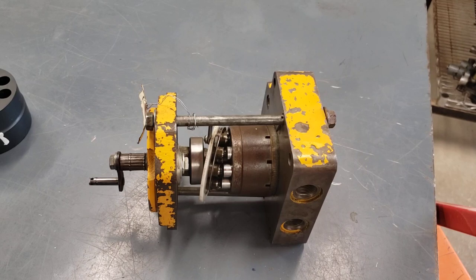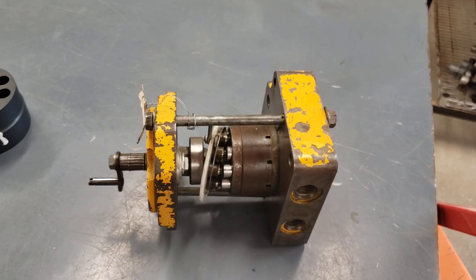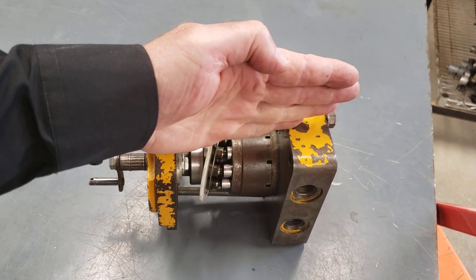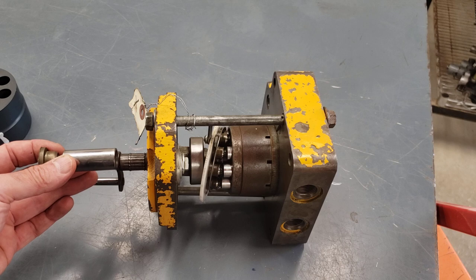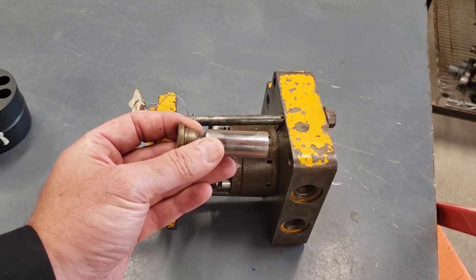So I want to start looking at axial piston pumps today. There's a few different designs of piston pumps in mobile equipment, but far and away the most common design is the axial piston pump. Sometimes it's called an inline pump, because if you look at where the shaft brings power into the pump, it's a straight run and it's on the same axis as these shiny pistons that you can see. So the pistons and the shaft are lined up, they're on the same axis, so they call this axial, and that doesn't change in this style of pump.